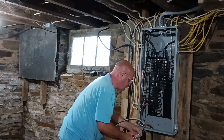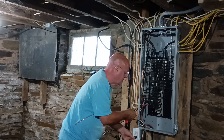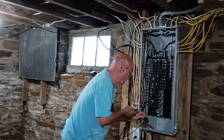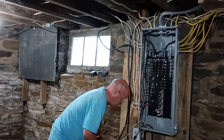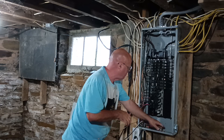So you clip all your debris off. Get your paper off the ground wire here. Always leave your ground longer, Jake, because it's a further run to your neutral bar. Now, in a main panel you can put your neutrals and grounds together on the same bus bar. But in a sub panel you have to keep them separate.